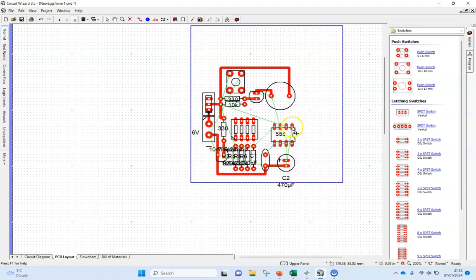So that's a little pin — pin number one is going to be ground. So where is that going to go? It wants to go through this way. We're going to wire that round there. Grab a wire from pin one, come out here a little bit, down to there, and that goes to ground. Pin one sorted — you can see the little green line connecting it up.